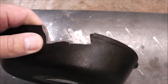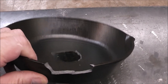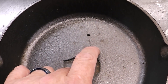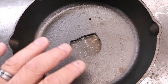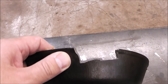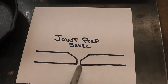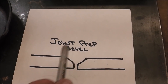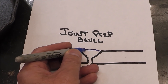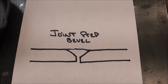Now that we've identified it's cast iron, we've got to go about repairing it. Here's one type of repair — we're going to start with the handle. Then we have another type of repair, which is a completely blown-out section in the bottom with a crack that extends outward. We'll start with repairing the handle first. That brings us to joint preparation — ideally you want to bevel it out a little bit and your weld will fill in like that.